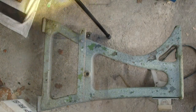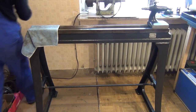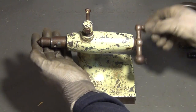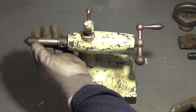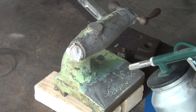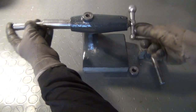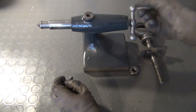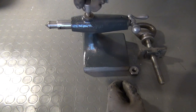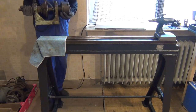Here you can see a before-and-after comparison for the frame and machine bed, and then also for the tailstock. Some of the most important lessons here: whether you use brake cleaner or gasoline to remove grease, or a needle scaler, sandblasting, or citric acid to remove paint and/or rust — you have to re-oil, re-grease, or repaint your parts immediately after, otherwise they'll catch new rust within hours. Second lesson: if you use sandblasting, block the media from entering any holes, especially threads in your workpiece.